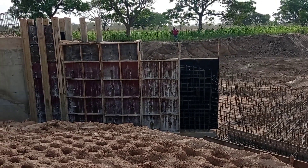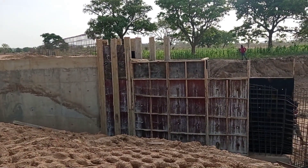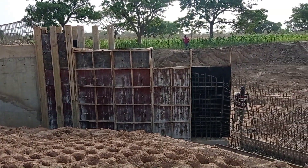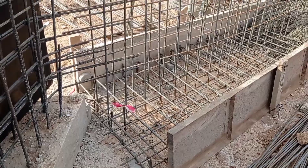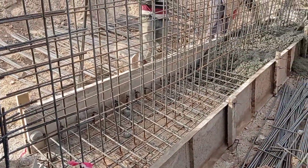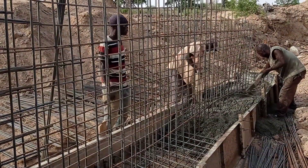And then gradually the height was reduced to 1.5 meters. We had to use Y12mm bars; the runners were also Y12. So all in all we used Y12mm bars. The center-to-center spacing was maintained at 15 centimeters, over a length of 3.3 meters.